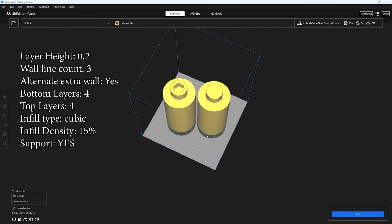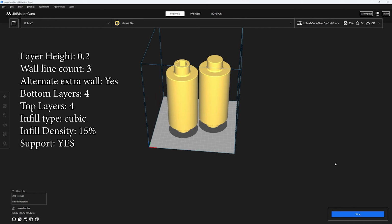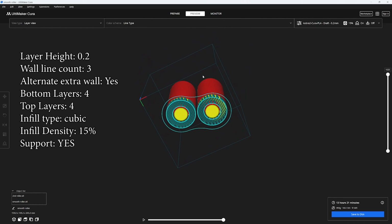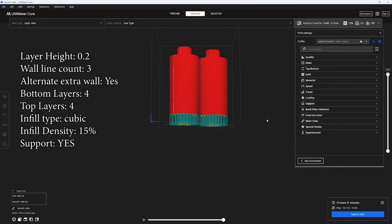Next up are the top and bottom rollers, and I really like to avoid supports whenever possible, but there was just no going around it for this one. So you're going to need supports, and you're going to print them upright just like this, with that little hex hole at the top. Really you could print off 2 rollers with hex holes in them. I haven't found that it makes that much of a difference, but I like to have 1 solid roller and 1 hex key roller. I like to use this zigzag support because it's super easy to use and it's not a super complex geometry that needs a ton of support.